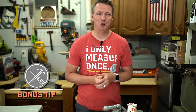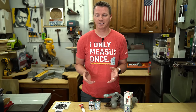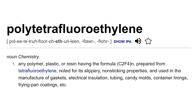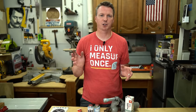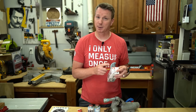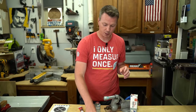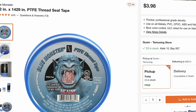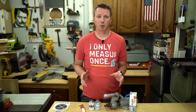A couple of bonus tips on selecting the tape. You can usually use just about anything. Teflon is actually a brand made by DuPont and was never produced by DuPont as tape — it just means PTFE, or polytetrafluoroethylene. PTFE and Teflon are used interchangeably, like Kleenex and facial tissues. I typically go to Harbor Freight and buy a big 10-pack — about a dollar a roll at the hardware store. There's also Blue Monster, which looks more expensive but you get nearly four times as much tape, so it's very comparable in price and a little easier to apply — a bit thicker, definitely worth checking out.